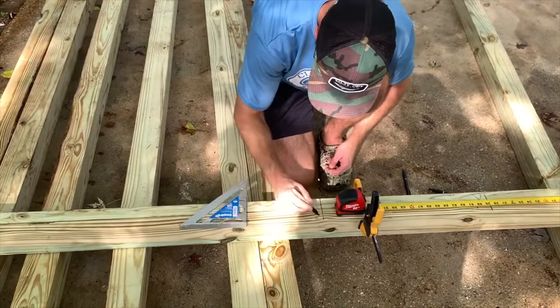So these panels have an overlap edge and an underlap edge, and you wanna have the underlap edge positioned in the center of a stud as shown. This means that when starting, you're always gonna have your overlap edge in the corner. So in this case, the corner is towards the front of the shed. So I have my overlap edge there and I'm making sure that it's perfectly in line with the front of the shed, and I want to make sure that it's perfectly plumb and square all the way across.